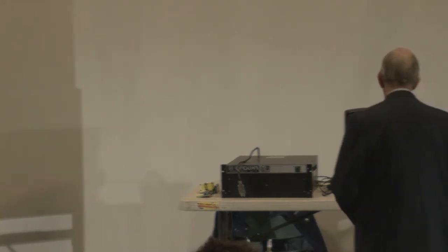You need to look at wire. I was going to talk about wire in the sessions that we have on speakers rather than on amplifiers, but there are charts that tell you how much resistance is in a wire. If you take a standard 12 gauge and you go something like 150 feet, you're approaching the point where the resistance of that wire is going to be significant compared to the impedance of the loudspeaker, so you're getting losses in the wire. You get them at 100 too, they may not be as much. Even at 25 feet you'd get losses in the wire, so you really have to pay attention to it and be careful.